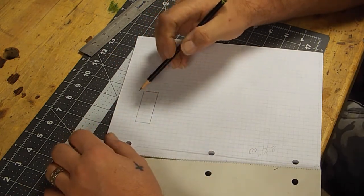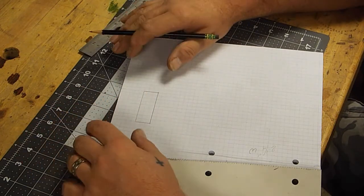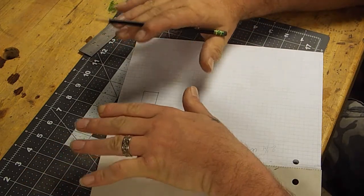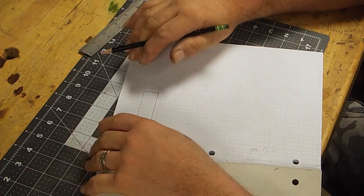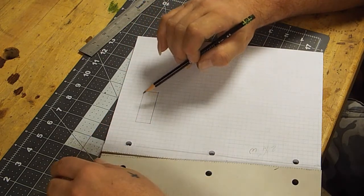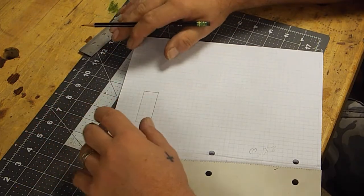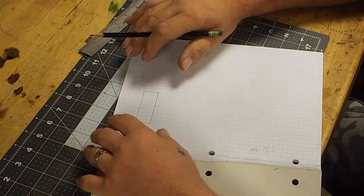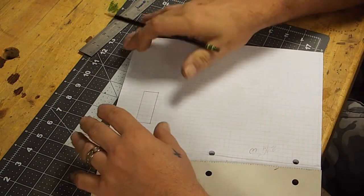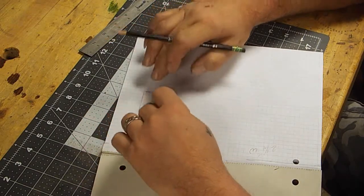You can do coves. If you just go watch Izzy Swan, or there are a bunch of other guys who have done it too, where you lay the boards out, clamp them down on the top of your table saw, and just raise the bit up slowly. Kyle Toth did waterfront cabinet covers or some such doing that process. It's pretty amazing stuff you can come up with. And there's a calculator on the internet that will tell you the angle and the height of the blade and all that stuff to get the profile you want. So you can do it.